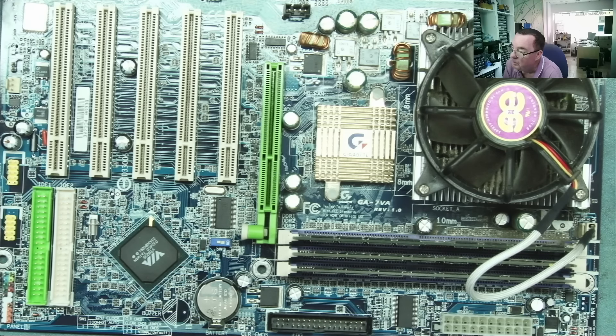Let's see if this boots up. I don't have the graphics card attached at the moment — there's no onboard graphics on this. Power supply on — what does it do? It's booting. C1 is normally a RAM problem. Oh, it's gone past that and it's asking for a graphics card — 2D, that's generally asking for a graphics card. I've inserted the graphics card that came with it, attached to the VGA monitor.